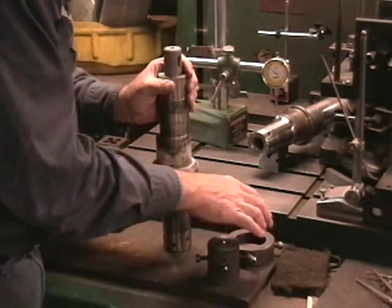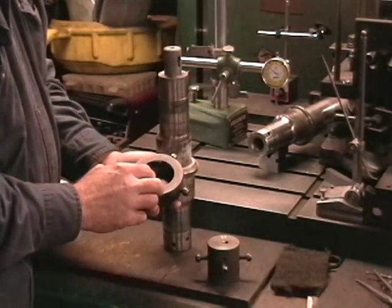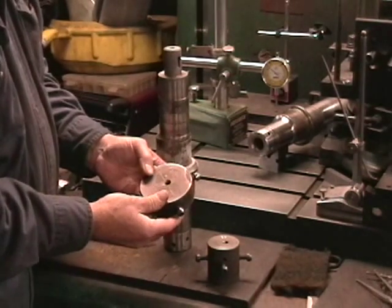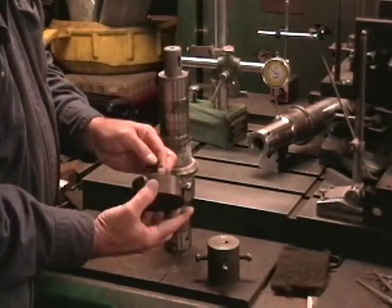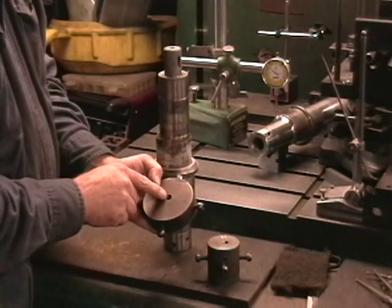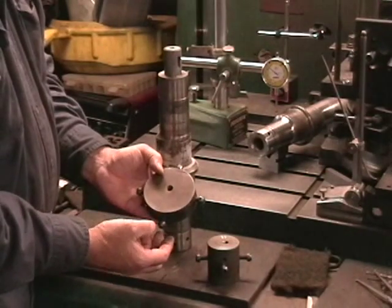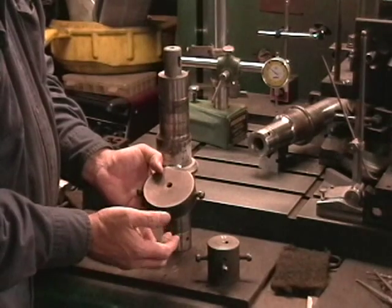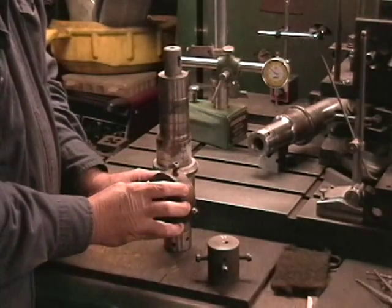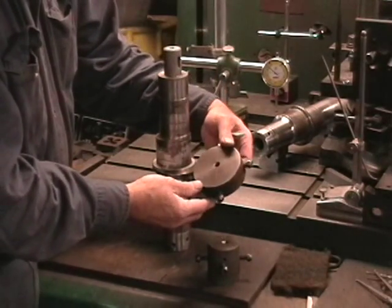I built a set of pots to turn it between centers. These were machined on a lathe and then on the Bridgeport I picked up the outside — they were concentric. I picked up the outside, offset and bored a hole so that I could later tool in a center, then marked it off and machined it off on the sides. They have scribe marks, hard to see because they're kind of old and gray. They're brown from heat because these are also used to weld these parts.